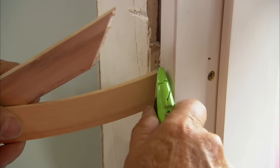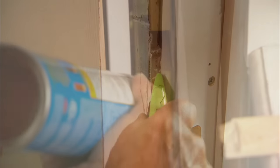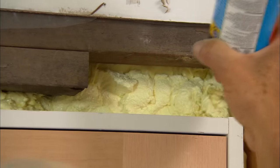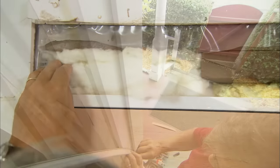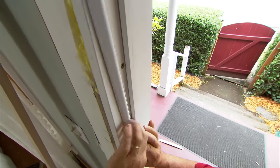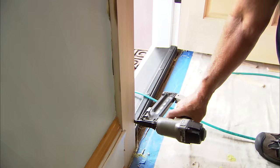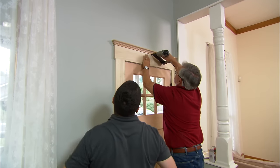Now we cut off the shims. I spray foam up the sides and across the top of the door, then fill the big gap at the top with fiberglass insulation. Then I reinstall the weatherstripping into its slot to seal the edge — it also hides the screws. We were unable to use the old casing, so we made up some new ones.